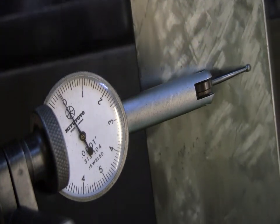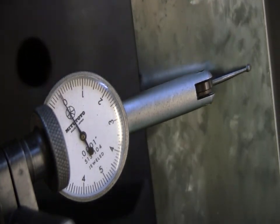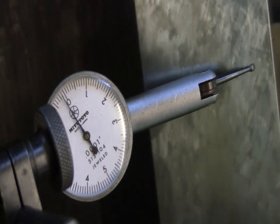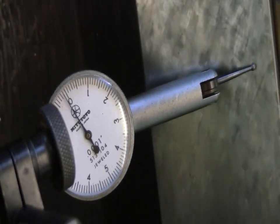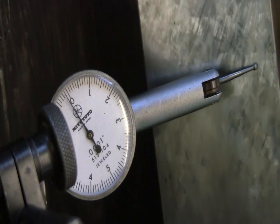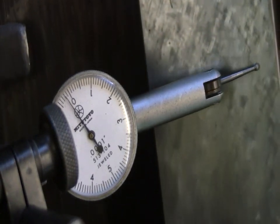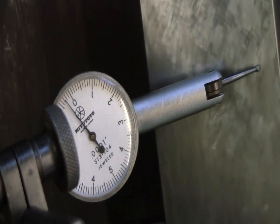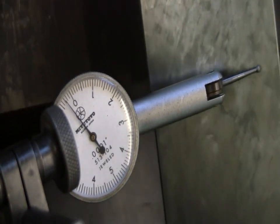Here is a video taken recently showing that the rail is still straight. The straight edge being used is not the same as the one used to scrape the rail. You can see that about half the error is because the straight edge is not level — or rather that the rail is not parallel to the table. I got a similar error when I indicated the table.